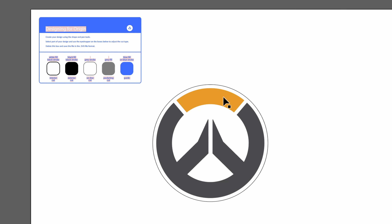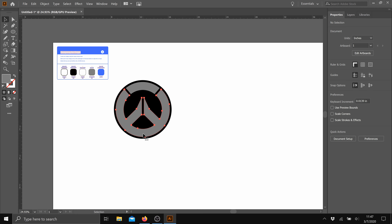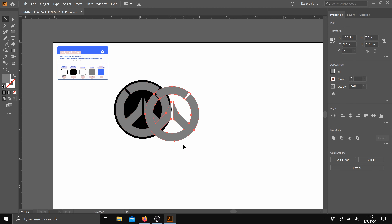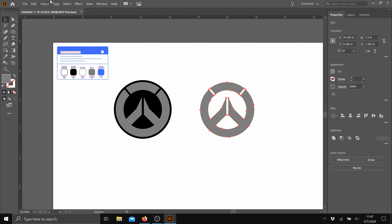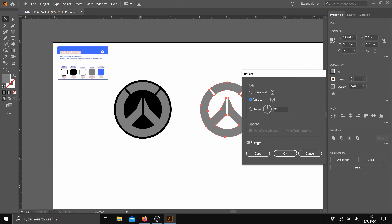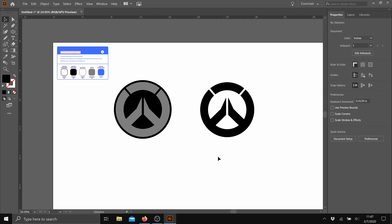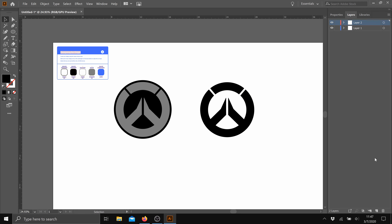Now I'll set up the coloring. For the plaque, I use a pocketing cut for the places where the inlay goes and an exterior cut for the plaque body. Then I'll copy the paths for the inlay and flip them horizontally, because I'm not cutting all the way through my quarter inch material — the 1/32nd inch bit can only cut about 1/8th inch deep. This will make more sense when I actually do it. The inlay pieces are set up as exterior cuts.